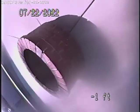We want to use very low pressure hydro-jetting to clean out the grease. We definitely recommend the pipe in the front be replaced and a two-way clean-out be installed outside the house to help with clearing any blockages. The cast-iron is definitely getting old — it is functioning, but it's getting old. You've got to be very careful what you flush: no tampons, baby wipes, or paper towels. If problems continue, we'd highly recommend replacing the cast-iron pipe, though this is all on a concrete slab.